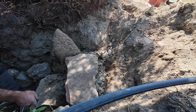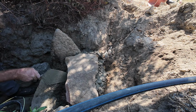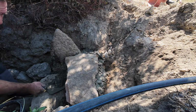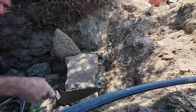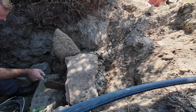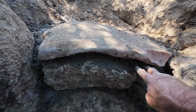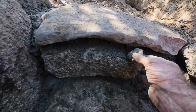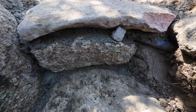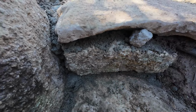What I'll have to do is, all this front where the concrete is underneath here, I'll scrape that out like so. Use that back in there. So, what I'll do is this gap, I'll get some small stones, something like this, and mortar them in just to fill that gap. Obviously I can't use concrete as mortar, because of the big lumps in it. It's not very good for laying stuff on.